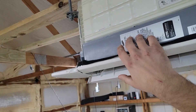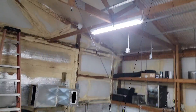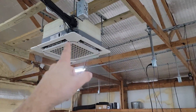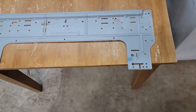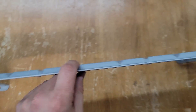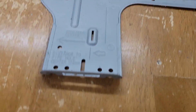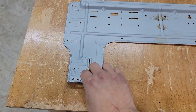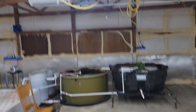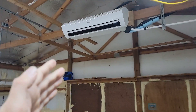This unit sits flush with the ceiling. When you install it, you put it flush with the ceiling and then draw the fascia panel up to the cassette. The difference between this type of unit and the wall mount is that the wall mount just has a metal bracket — kind of leaned out like a hook — and the unit sets on this hook. Then you've got two little bottom pieces that hold the unit to the wall, so you just screw the bracket to the wall, set your wall mount air handler down on it, and it's a much easier install.